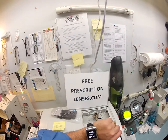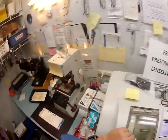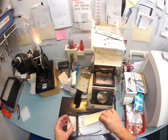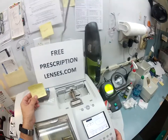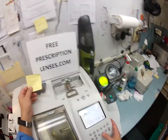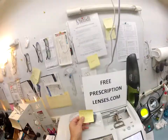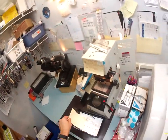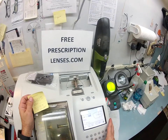It is now 7:44 on Monday, March 10th, 68 degrees in my hometown of Durham, North Carolina, at least according to my Samsung Gear watch. Let me flip this over so no personal information is seen. Your pupillary distance — entering the frame PD of 71. Your right eye PD is 31, your left is 31.5. This is a polycarbonate lens. I'm going to cut on the soft cycle for a semi-rimless frame.